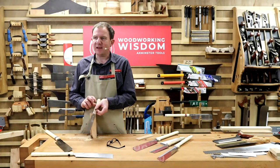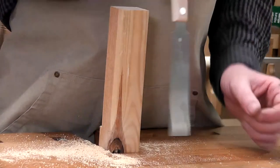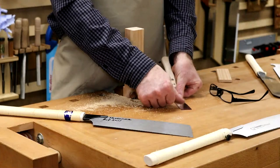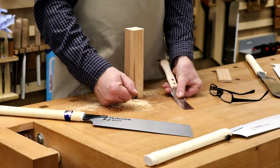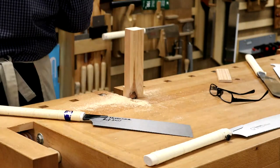Now, this doesn't have any set. We're going to play with this later, okay? Ben, you can maybe just have a quick look. I'm going to pick this up again later. It's quite flexible. Now, it depends on what kind of kink you've made, Frederick. If it's this saw, you might be able to lay it on something flat and gently tap it with a hammer. The hammer will need a bit of a radius edge. Go careful, because you don't want to damage the teeth too much, but you might be able to flatten it out on that one.